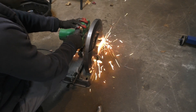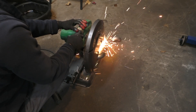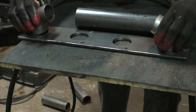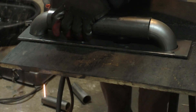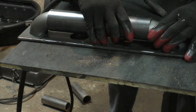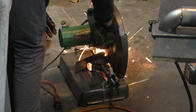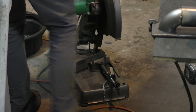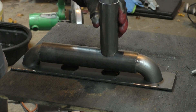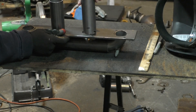After that I got to making the tube section of the manifold. I started by cutting the two 90-degree parts from the bent tubing. Then I placed all the different sections back at the flange and tack welded them together for now. Next I had to make the two inner tubes — the two holes left on the flange need tubes going from there to the collector. For making these I had to notch them first by cutting them at an angle on the chop saw. Notching is important whenever you're welding round tubes to other round tubes so they fit properly.